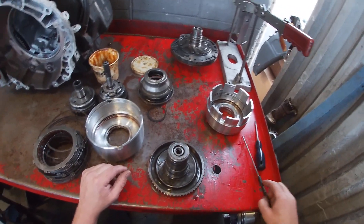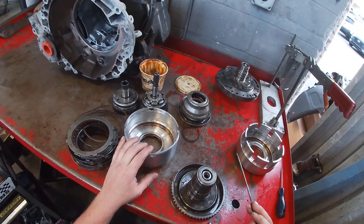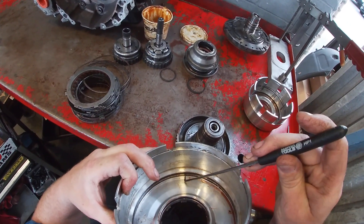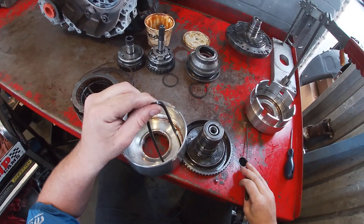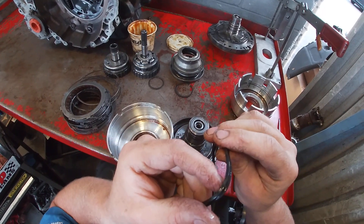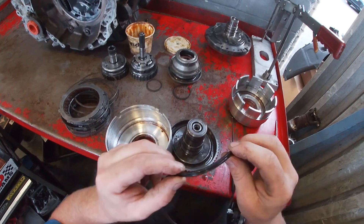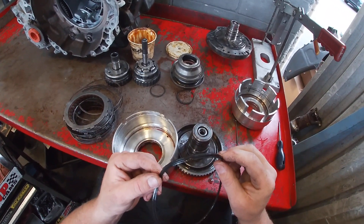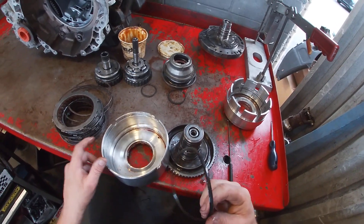What we would normally do in a normal overhaul is start to go through these baskets in this hub assembly and replace the seals. One of the things you want to make sure of is you're paying attention to what groove they go in and their orientation. If I use this lip seal as an example, it does have a lip on it, so there is a direction this seal needs to go. It's very easy to get mixed up with that. I usually like to put my seal kit on one side and go through each seal one at a time, so you can size up the old seal to the new seal and you're not getting it in the wrong location.